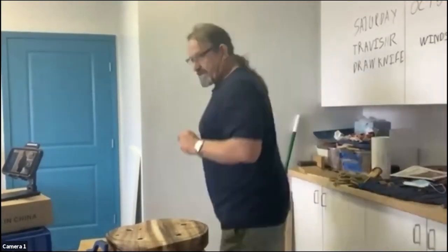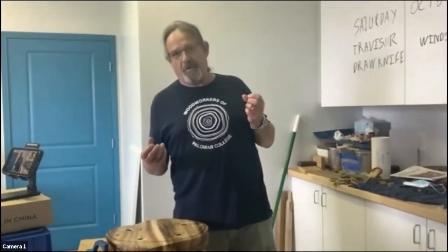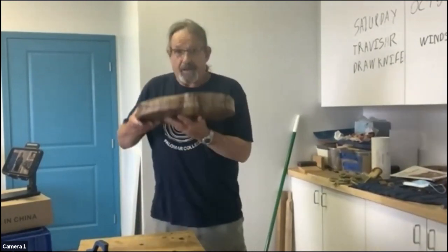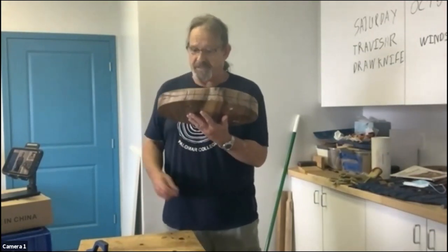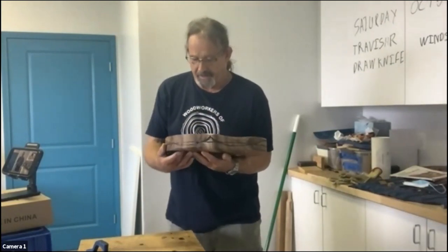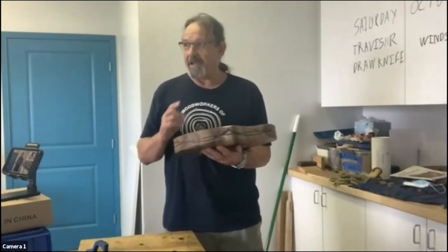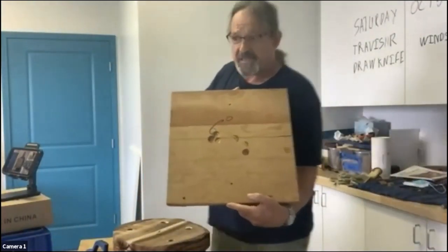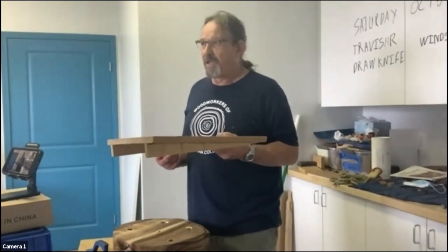So I came into the shop on Thursday, and one of the features of this seat is that all the legs have at least two angles — they're compound angles. The back legs are angled at 6 degrees outwards and 12 degrees backwards. The front legs are a little wider apart, angled at 8 and 15 degrees. What I normally do is use a combination of two ramps — one made up for 6 degrees, another for 12 — and you carefully line them up, know where your hole is going to be, and drill through from the bottom using those two angles.